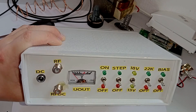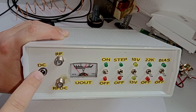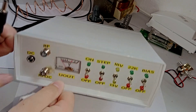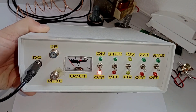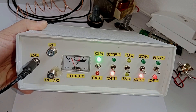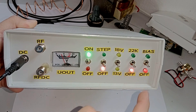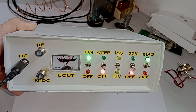This device takes that and adds extra functionality. We have a bunch of switches. The first one is the master switch which just connects the DC port. If it's turned off, nothing works except the indication LED. I'm going to plug it into the computer — by default only the off LED is on, indicating it's getting power. We can turn it on and the rest of the LEDs light up. At the other end we have the BIAS switch, which is another on/off switch for the RF DC port, and if we turn this on it is now acting as a normal BIAS-T.